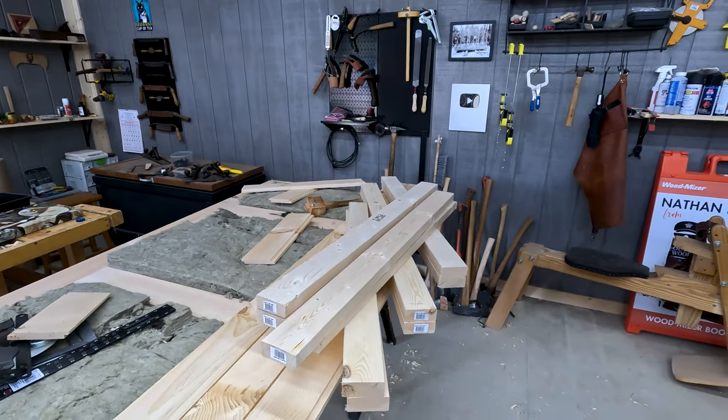And for the base of the pallet, all you need is some store-bought 2x4s. I recommend these because they're kiln dried and they're the same dimension. That's real important for drying. So once you get your material cut to length, the first thing you want to do is lay down your measuring tape and mark off all your 2x4s, or place them where they go, rather.